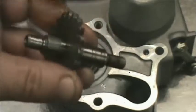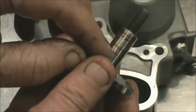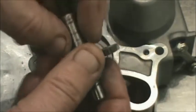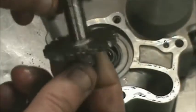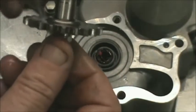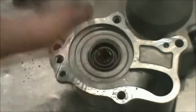Here's the drive for the impeller. Just make sure when you're looking at this you can see some marks here — you can't feel it, you shouldn't be able to feel any ridges on this. If you do, you're going to develop a leak. Be careful when you push this in — it's coming in from this side. Make sure there's no burrs here, this has a nice chamfer on it. Make sure you're not going to tear the seal up when you push this in.